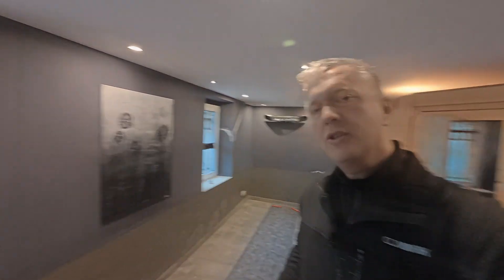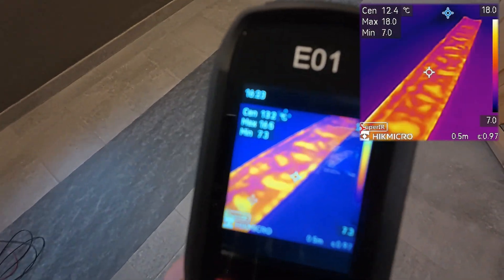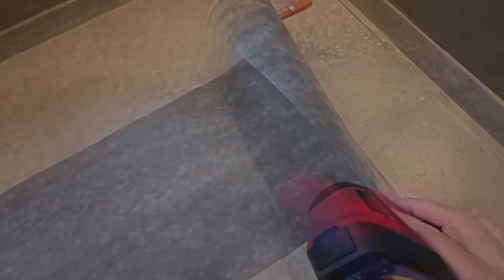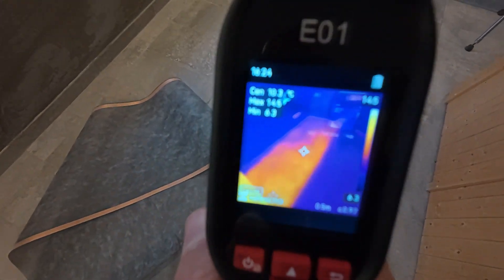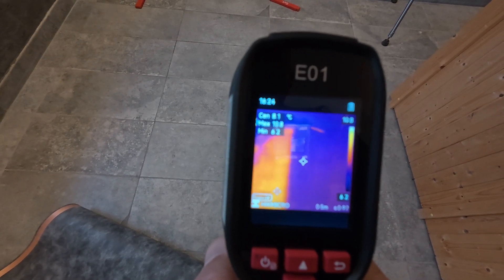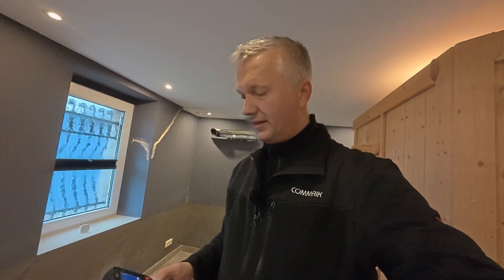The heating film has now been running for about a quarter of an hour, and it's time to see the results before installation. The film is still not evenly heated — there are a few hot spots, which result from the film being slightly suspended in the air rather than lying flat. To see whether it actually works well overall, I pulled the film back. You can clearly see the floor underneath: the spot where the film was sitting shows a significant 10 degrees in the middle, compared to 8.1 degrees on the adjacent tile next to it. So about 2 degrees gained in a quarter of an hour on this cold tiled floor.